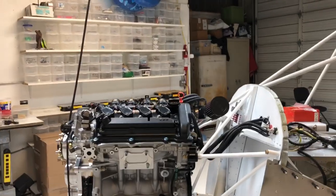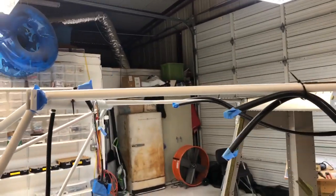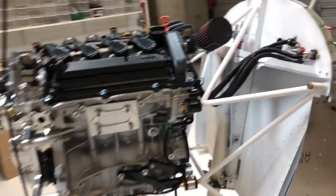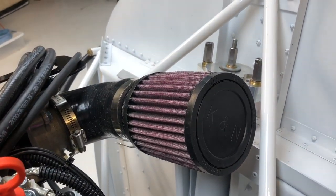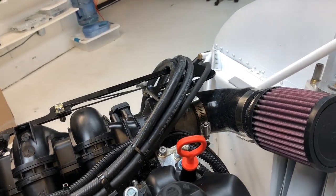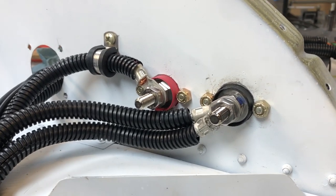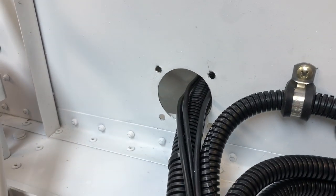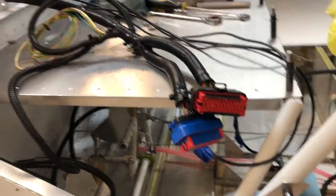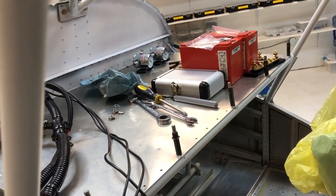You're going to check your angle of the engine anyhow — it's going to be horizontal with the top of the cage, or up to one degree down is acceptable as well. So we got all that done. I did throw the air cleaner on yesterday. We got some of the hoses unraveled. This engine had been prepared a little bit before it got shipped. We got started on opening up for the harness that's going to go to the ECU. Alan's already installed a shelf back here, which is perfect — we're going to use that to mount our contactors and batteries.